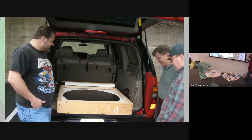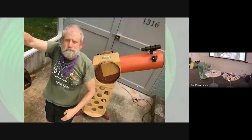Okay, so this is not a good one. So this is a BBC mirror that was made by this fellow named Deck. He was showing that to us. Looks like about 16, 19 inches. BBC's black vitrified ceramic. And it was sort of a sandwich of different layers of ceramic and glass, and it was very soft and apparently figured very, very well. And in fact, Jan Wisniewski, who I think has moved away from this area, made a beautiful, beautiful telescope using the same stuff.